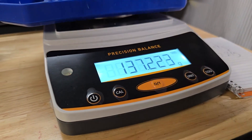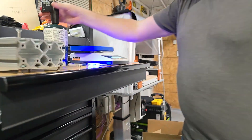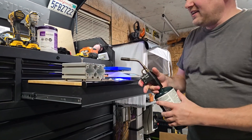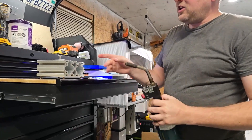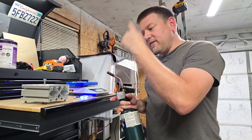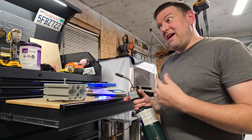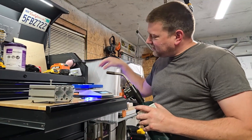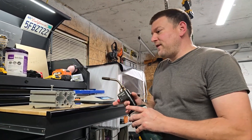The very next step is we need a heat source. Since it's a vacuum chamber, I can't just run wires into it because that will create leaks. So what I have here is a high-density block of aluminum. It's got a lot of channels so it can store and give off a lot of heat through convection — although it won't be convecting very much since there won't be much air in the chamber. Nonetheless, it will give off infrared radiation, which will go into the PCB and maintain the temperature we need to evaporate the liquid.